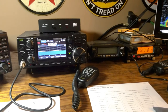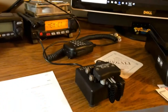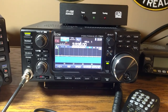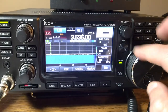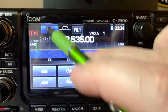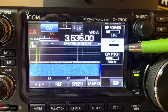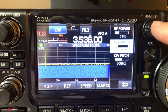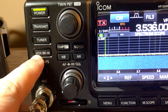Now I want to show you the setup. Most modern radios have what's called an electronic keyer built into them. It's going to take the signal from your key and convert it into dits and dahs based on the frequency tone that you set — whether it sounds like a lower or higher tone — and the sending speed. On the Icom 7300 that's easily adjusted. You go to the CW mode, and once you're in CW mode you can see the keyer speed — how fast you want to send — and the pitch of the CW waveform tone.